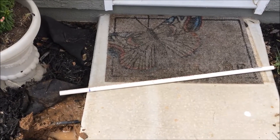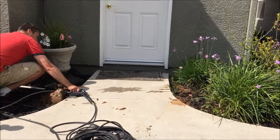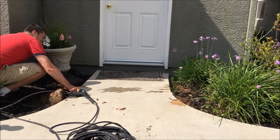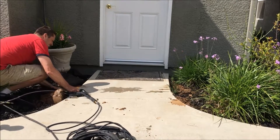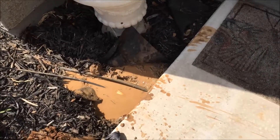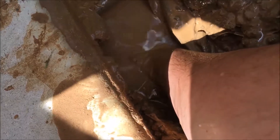I'm going to try to inch that PVC all the way underneath the concrete using this pressure washer. As you saw, that worked pretty good. The pipe is all the way through — you can't see it because of the muddy water, but it's about six inches down there.